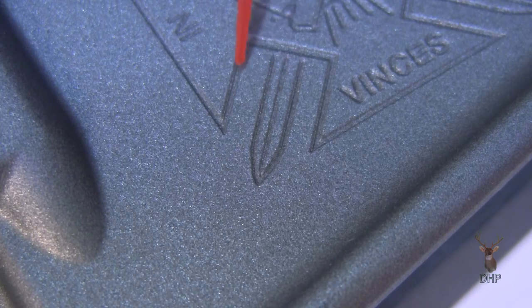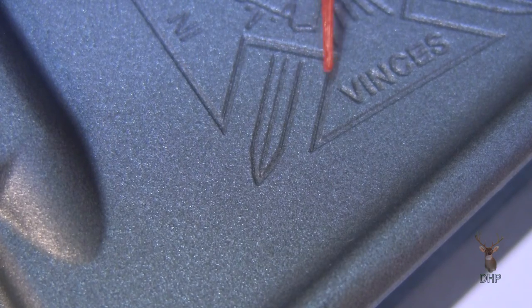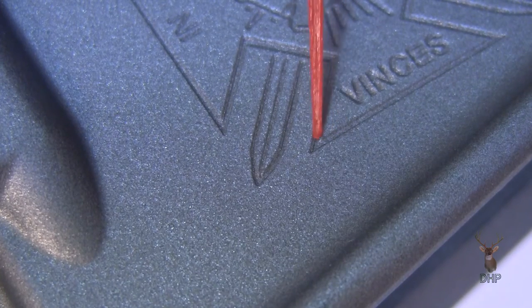One of the things I visually detect is a layer and then a deep one — it's like it's been cut into two layers: a wide layer and a narrow layer to approximate that nice saddle shape we had on the roll die. These edges are fairly sharp and visually distinct. I spy a deep narrow cut to get the depth out of it, and then a wider shoulder cut up above. So there's some work that goes into doing something like this.